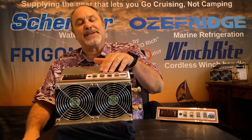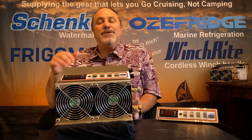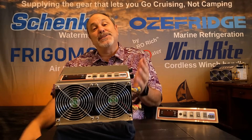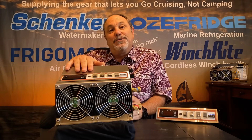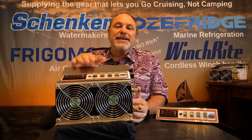The control also gives you an easily viewable alert light. If the unit trips off, this alert indicator light will flash a number of times — two flashes, three flashes — telling you why it tripped off. Knowing why it tripped off can help you figure out what to do to make it run again. Was it low voltage? Was it a compressor overload? Was it an overheat? Was it a fan over-amperage? Those things will help you troubleshoot and tell you why it tripped off.